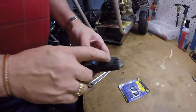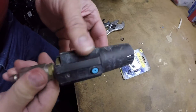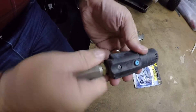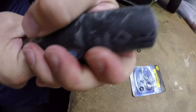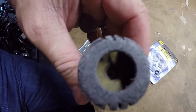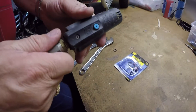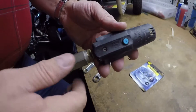This particular nozzle has a stop feature. If you turn the bottom part all the way to the left, to the arrow, it will lock the black housing so it doesn't rattle and the ceramic piece inside will not spin. It'll be just like a fixed zero degree nozzle, spraying in one direction. A lot of people don't understand that with these particular nozzles and they think they don't work when they're tightened up in this position.